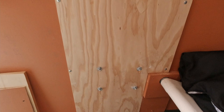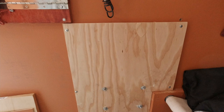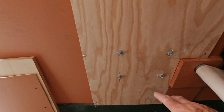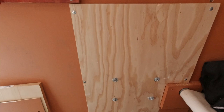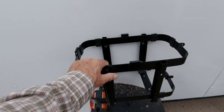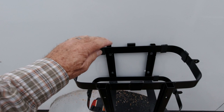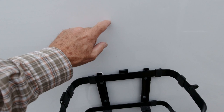I put those two half-inch fill pieces inside the wall, and then this piece overlaps by a large amount and makes sure it takes in two frame spaces — it attaches to two frames here, so it really distributes the load. You can see the four bolts down here for the mount itself. It comes up really high, and I'll show you why in just a second. This thing is really stout — it's really on there. The reason I brought it up so high is because the top of the jug is up here and that jug is going to rock. So I'm going to put a pad eye up here and strap the top of the jug over to the pad eye.